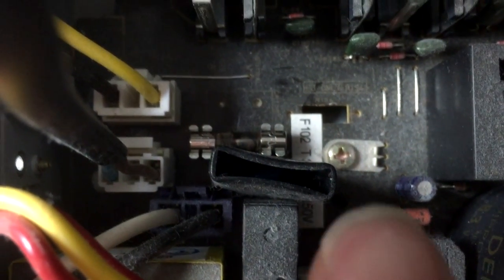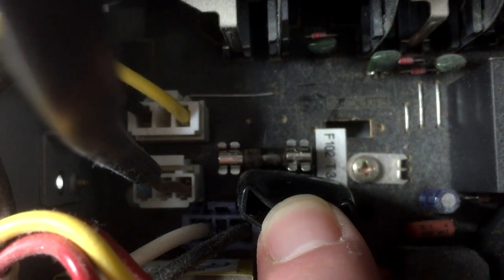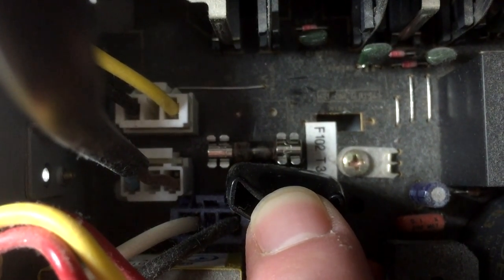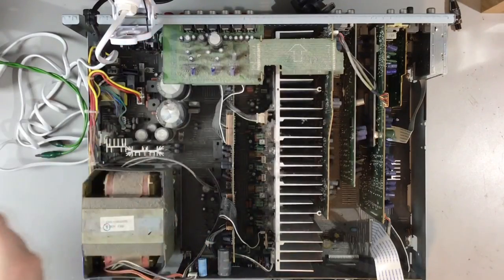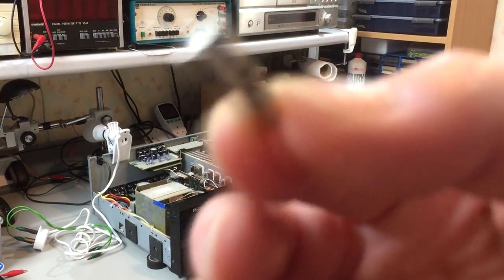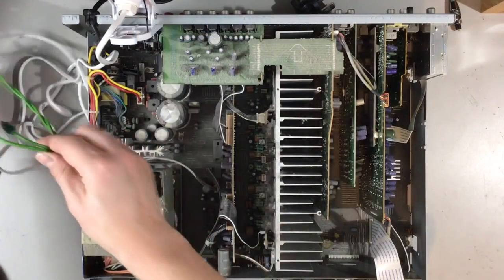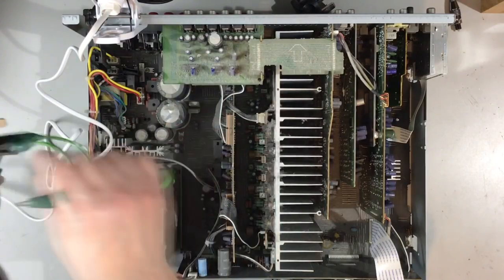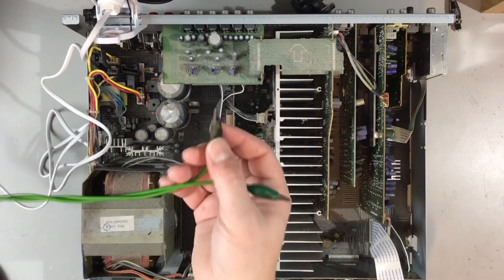Here's a close-up of the fuse that's gone — you can see it down here, just behind this boot. It's a glass fuse, but the inside of the glass is coated, so that's definitely popped. A multimeter confirms that it's now open circuit. So let's pull that out and replace it with the filament lamp. You can see it's well and truly blown inside. We're going to replace the fuse with a lamp jig — a 100 watt filament lamp wired up to some crocodile clips with a bit of insulation. If you're repairing things like this, you're going to be familiar with electrical safety already.